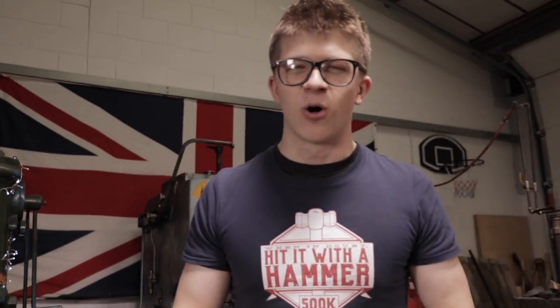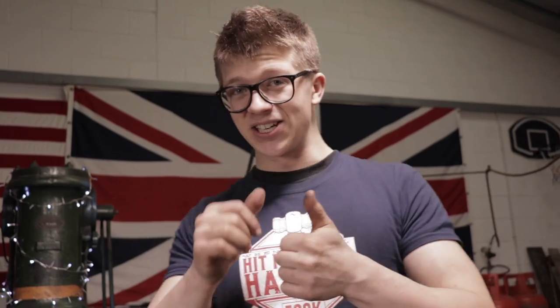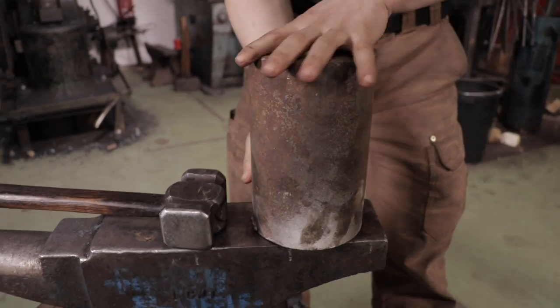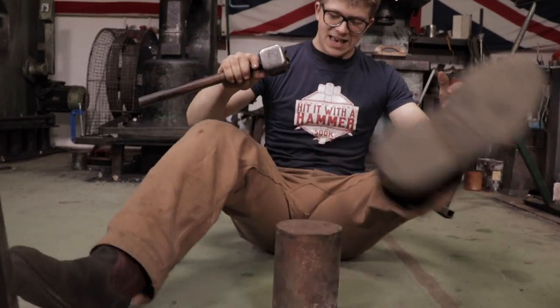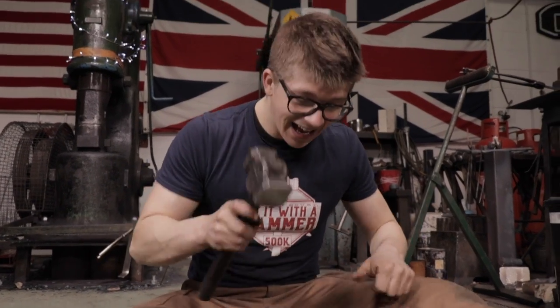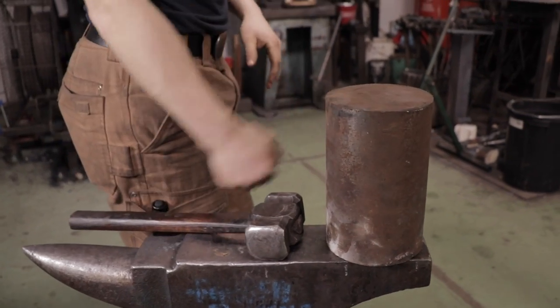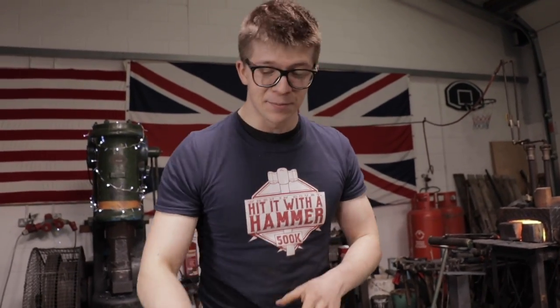An anvil looks pretty confusing if you're new to it, or it looks like you really need every bit of it. The reality is, the most important thing about an anvil is that it is heavy, it is securely mounted, and it's not going to dent too much when you hit it with hot metal. In a pinch, you can take just a lump of mild steel, set it in the ground, and use it as an anvil. You can put it in a routed hole in a stump, epoxy it in, bring it to about knuckle height, and work on just a piece of round steel. It just wants to be heavy and securely mounted — you can get away with something a lot simpler than a normal anvil.